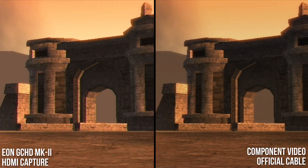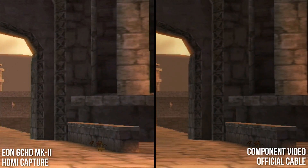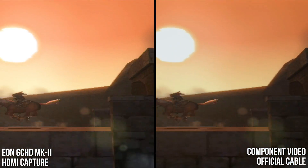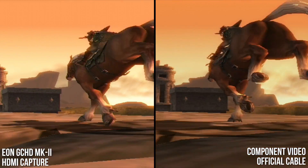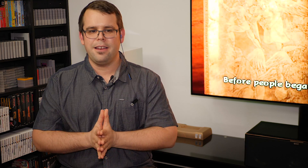In both analog and digital HDMI mode, the image quality is improved. The image is slightly brighter and a little bit sharper. One of the curious things about the GameCube is that it doesn't entirely process the video in the RGB color space — it uses YCbCr instead. Technically using component cables kind of makes sense there since you're staying in that color space. Converting it to a SCART cable involves converting internally from YCbCr to RGB, though I didn't really notice anything much from that conversion. One thing you really dialed in, Mark, is what kind of look like chroma subsampling artifacts.